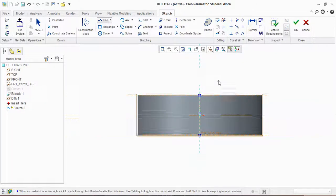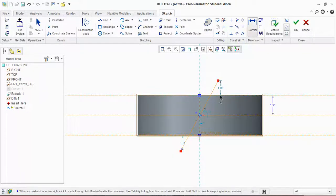Now draw a line that will cut these three lines — cut from here on its center, then check that these lines are parallel to each other. I have a helix angle of 20 degrees, so this should be 160 degrees — that is 90 plus 70. Click OK.